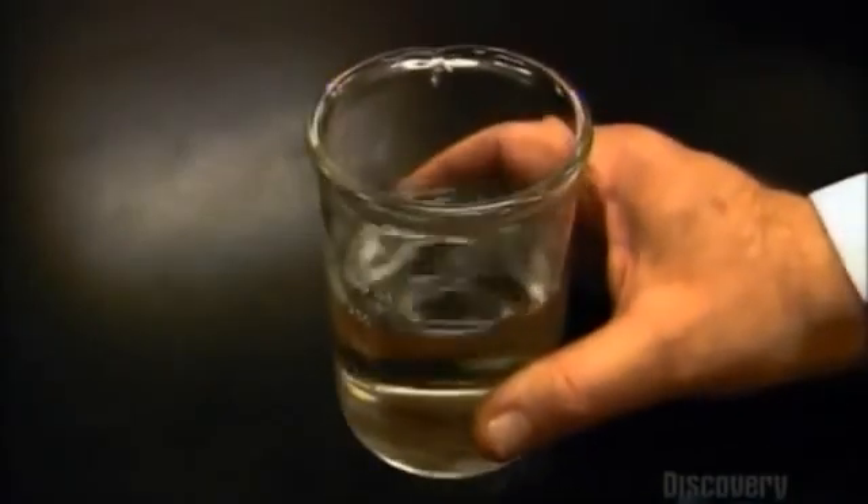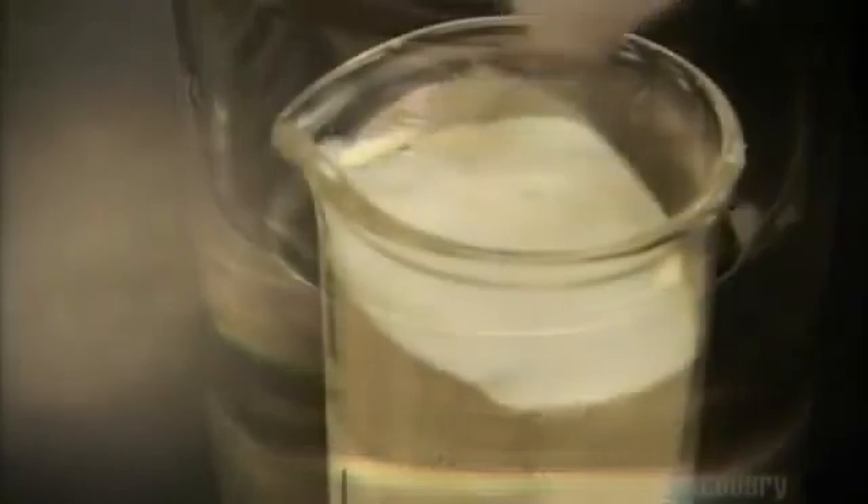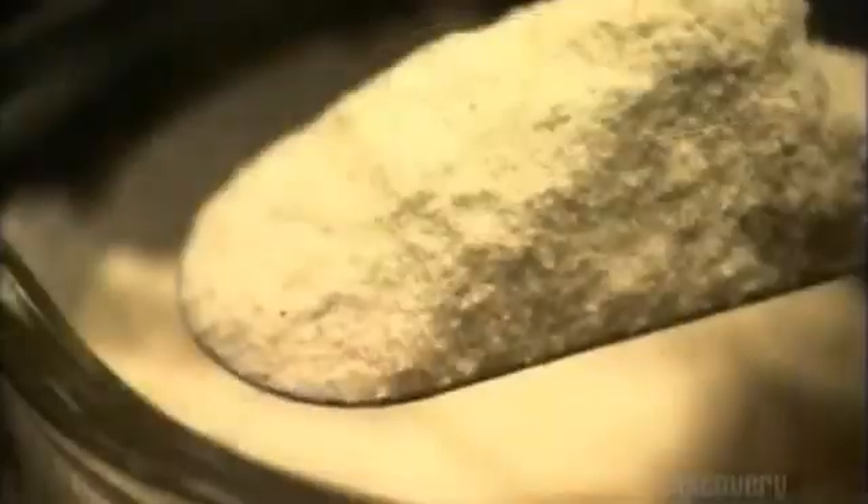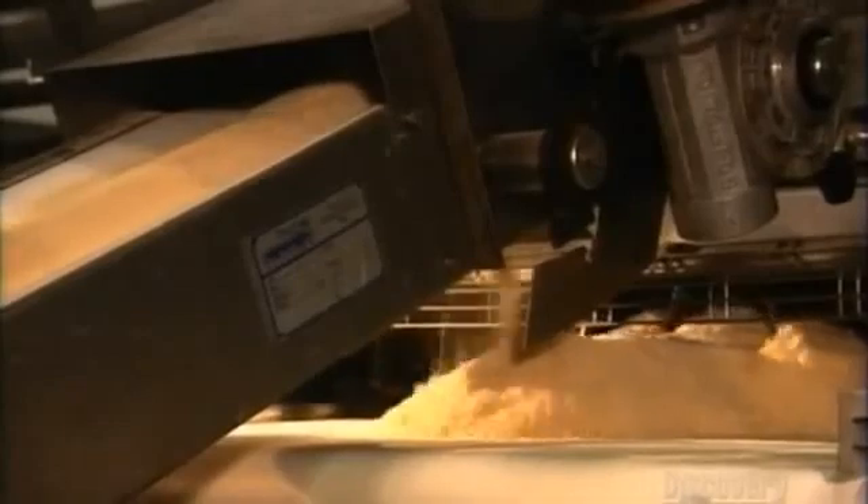The lidded tubes are now turned upside down — they're ready to be stacked with chips. To make stackable chips, they use a ratio of one-third water to two-thirds potato flakes, with a little cornstarch mixed in. A conveyor delivers the mix to an auger, which disperses it.